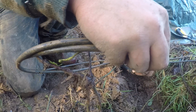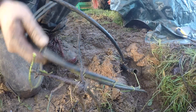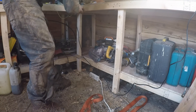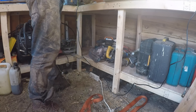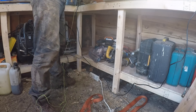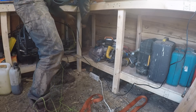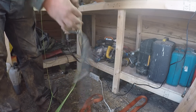So we're going to feed that in there like that and then start pulling the cable in. It was going round the wrong side — I'm going to have to move the other cable round it. Let's start pulling this, see how we get on. It's coming. It's getting stiff. They're there — awesome! Worked. I'll pull it in as much as we need, tidy it up out there, and bury it again.